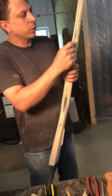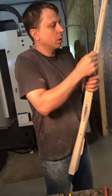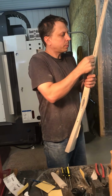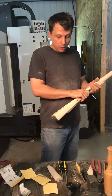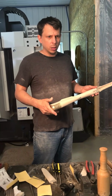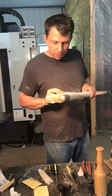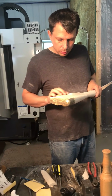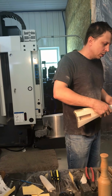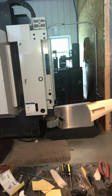If you're okay with a little coarser finish, maybe just go with one. If you want a finer finish, maybe do it 3 times or 4 times if you want an exceptionally fine finish. And a lot of it depends on the wood too. Some wood will really fuzz up, and real hard wood, oftentimes the grain doesn't raise very much at all. So it just depends. But I'm gonna go ahead and raise the grain on this wood one more time. So let me step over to the sink and get some water on the rag, and we'll put it on once more and raise the grain.